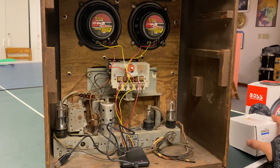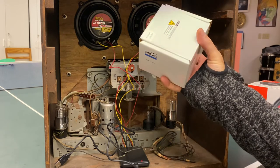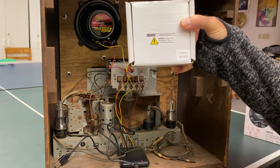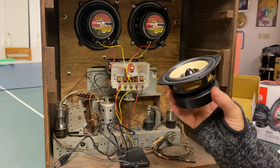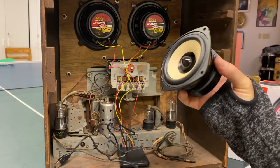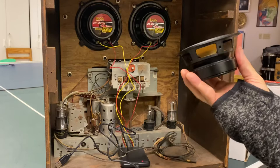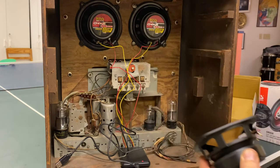Now, the thing I want to say about the speakers is their magnets are a little bit small. Here, just by comparison, here's a high-quality, high-fidelity 4-inch full-range speaker from Dynavox — the LY401F. I've used this speaker in another build. It's more of a hi-fi speaker with stable Thiele-Small parameters that are good for a vented cabinet. This is a 6-ohm speaker, and this single speaker costs about $25, so the Bosses are about half the price. And this magnet is big by comparison — about twice the size of the ones used in the Bosses.